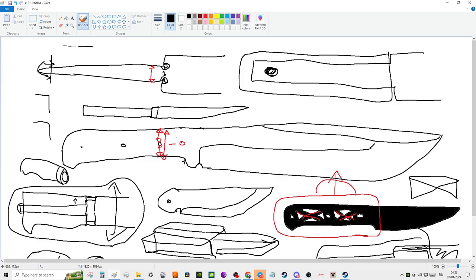You could actually, I'm not sure if this is stronger, but it would make sense if it was, fill that up with brass to have a sharp corner there, and to have a really nice fit. Which is the nice thing with full tangs, you don't necessarily have sharp corners there, which is where your full tang with your rat tail is going to be prone to fracture, because if it's not done properly, you got those stress risers at the shoulder, of course, and you don't see that on a full tang blade.